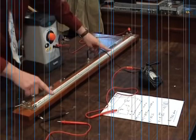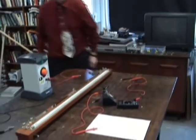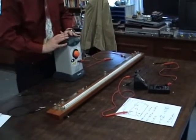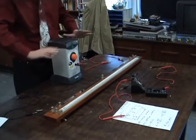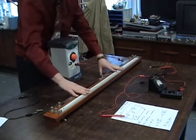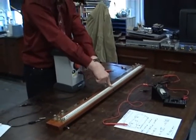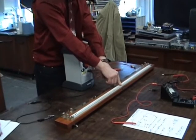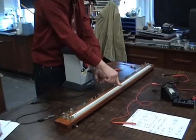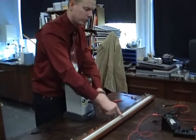And we'll take a look at that in a minute when we're looking at potential dividers. So for applications of this — this is used quite a lot where you want to regulate temperature control. So if you've got a cooker or an oven, you apply — basically you have your little pointer in the middle, your galvanometer, and you set it up such that it's rigged up at room temperature at 20 degrees. And you want the cooker, or it might be the air conditioning in your house, to stay off if the temperature is between 18 degrees and 22 degrees. Because if it's exactly 20, it'll be going on and off all the time.